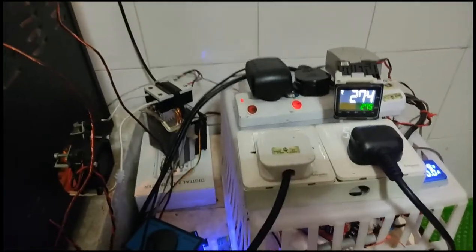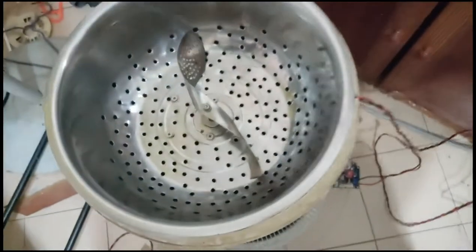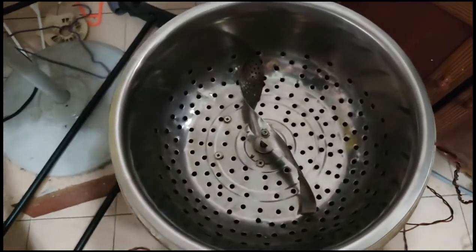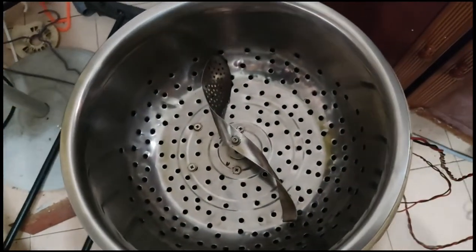Like I said, it's very messy. It's not something that I want to keep. I'm moving on to something after this, for which I will use my experience gained from this to make something much more presentable and durable. And here we move on to a homemade cooling tray, I drilled all the holes myself. So there's a motor attached below this pot, and it turns, and then there's a pretty powerful 12 volt fan below, which sucks air in, and at the same time it kind of sucks the chaff through as well, any remaining ones.